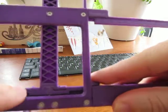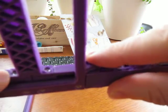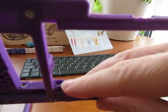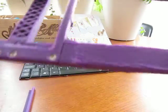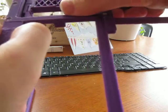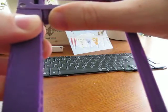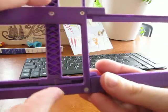This base middle part — you can see it's slotted left and right into there, and then there are two screws. I'm not actually certain those two screws are needed and I'm going to find out by removing them and flexing it. I think similar to this one, the indentation itself is enough to keep it from moving. The main reason for putting that screw in was to stop twisting, but I reckon just having that indentation is sufficient, because this screw keeps these two parts from being able to twist backwards and forwards.